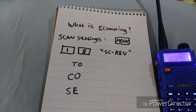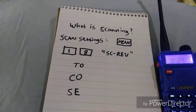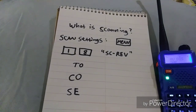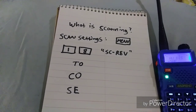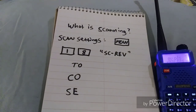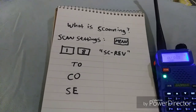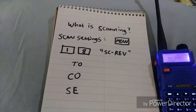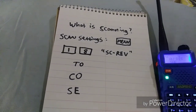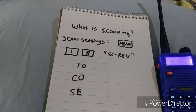If your radio is set up for disaster use, your radio will be set up to scan LA County Fire Dispatch, LA County Fire Command Frequencies, Sheriff's Dispatch Frequencies, and National Calling Frequencies — which is about 30 frequencies altogether. Now your Baofeng is not designed to be a scanner, and what that means is it'll scan slowly. To go through 30 channels it'll take about 7 seconds, which means you could miss quite a bit of radio traffic on any given channel.